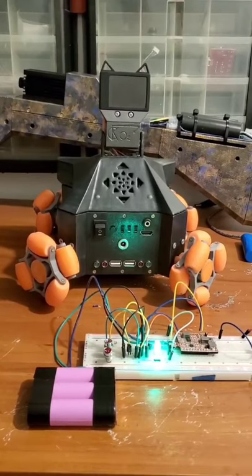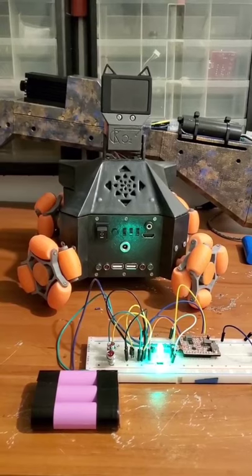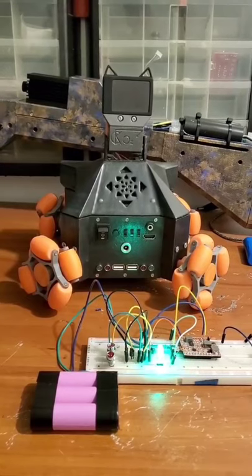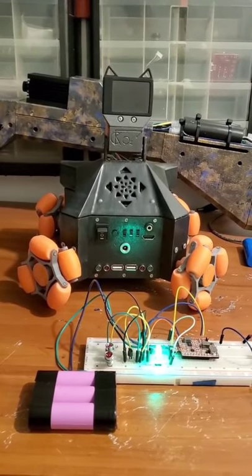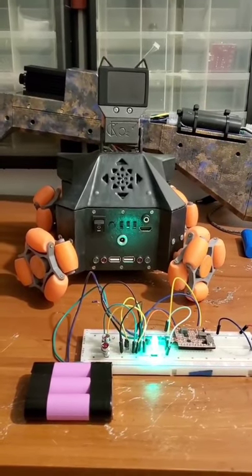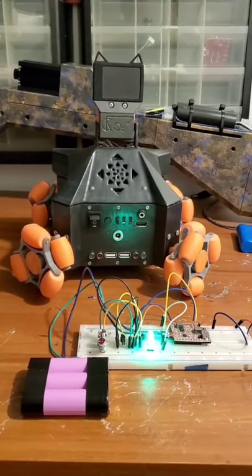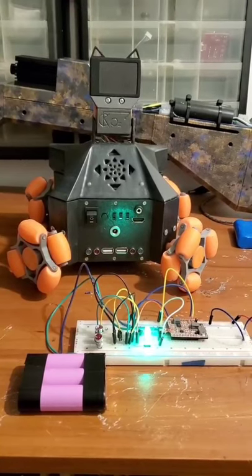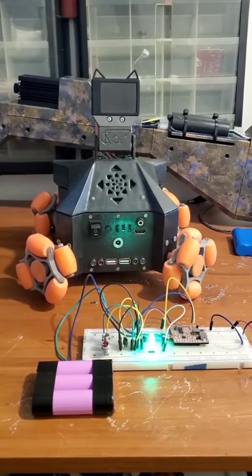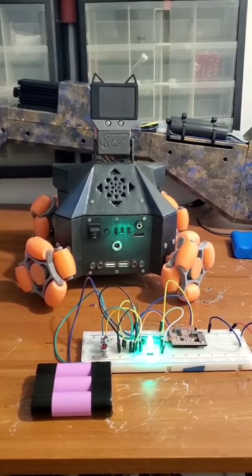Overall, I would definitely give this charge and boost board a 10 out of 10 review, and I would definitely buy this again — it's very useful for an assortment of different projects. 6 amps is by far one of the most powerful boost chips I've seen on the market, and that's going to supply more than enough power for most 5 volt projects. As you can tell from our test results, it's very efficient — most other boost chips on the market won't be able to power this robot at full power, and they do get relatively hot, telling me they're inefficient and wasting power on heat. This charge and boost board was made by Angry Helder Game Tech — I'll tag below where you can get one. My name is Brandon Cook with Cook Inventions, I hope you enjoyed this video, thanks for watching.